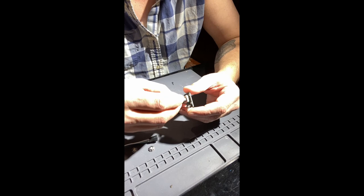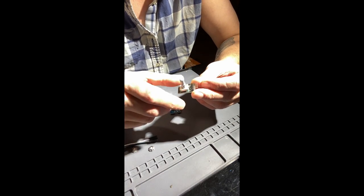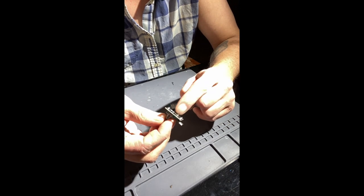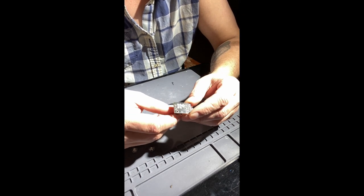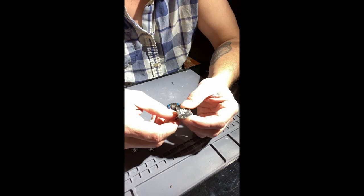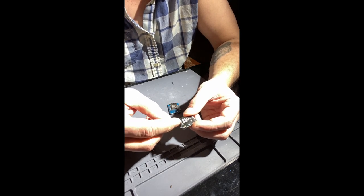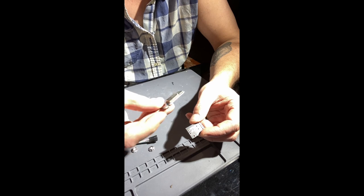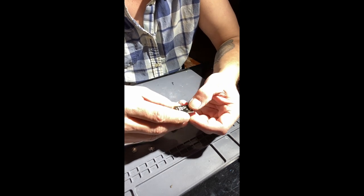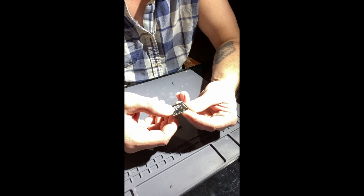As far as the potentiometer, I ran out of my singles, so I went ahead and just used this one and desoldered the board. On the potentiometer side, we have three pins. Actually, for the potentiometer, a ground, and then two pins that'll go to our ESP8266. And then we have two pins over here, and that's just for our push button action.